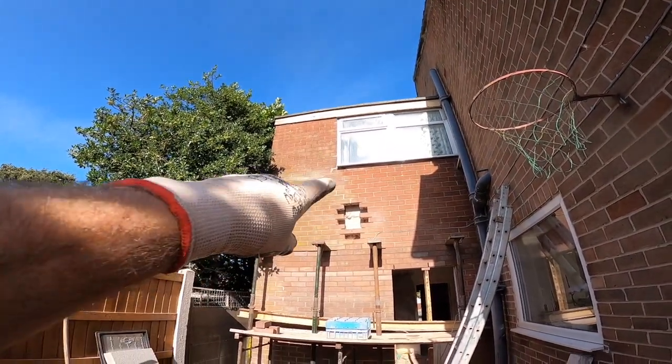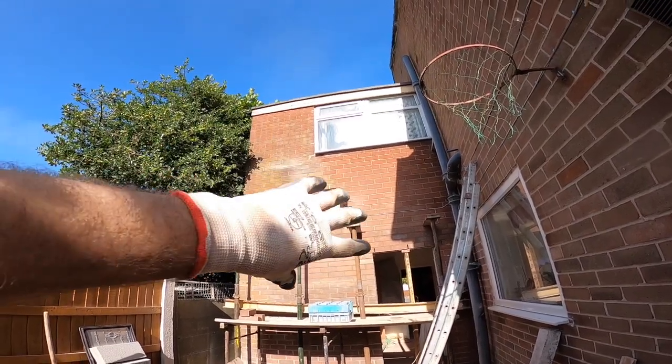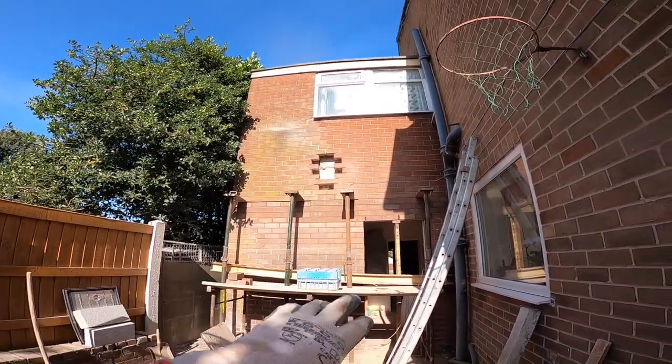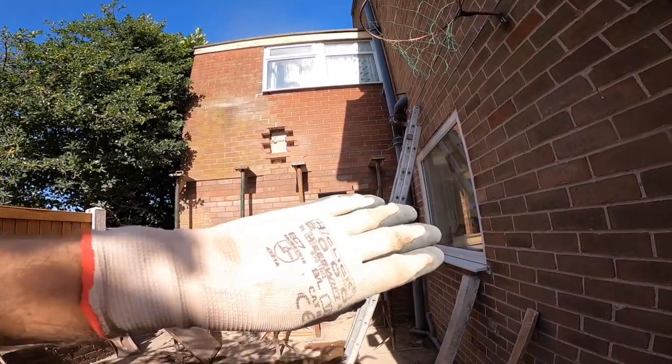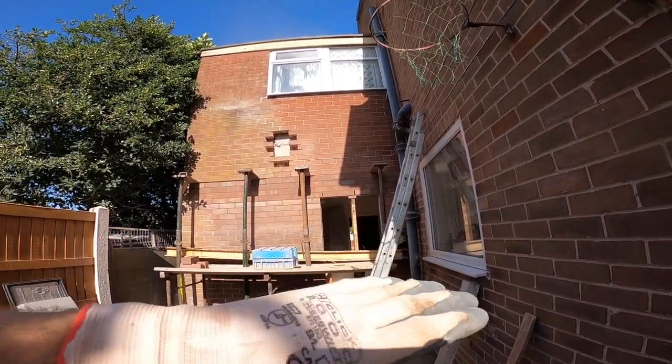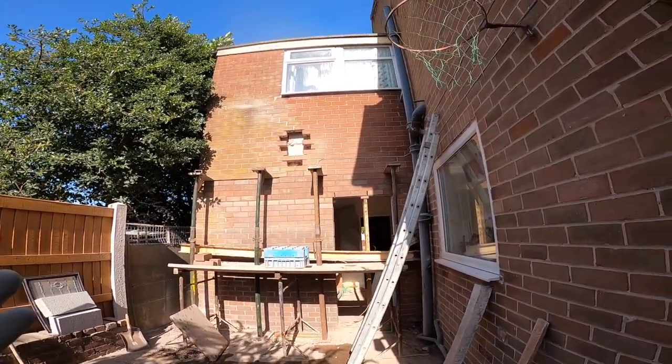That bit's all done, that's all dry. So the whole fracture right down the centre will all be fixed. Will be watertight. New lintel, we put a miniature tray under it. It's only going to step up 3 inch because we only had 9 inch damp. So it'll go from the angle iron onto the 4x3 concrete lintel. But it's doing the job.